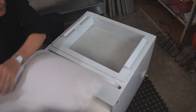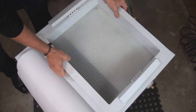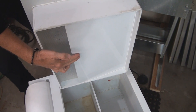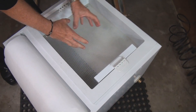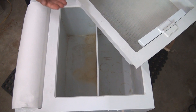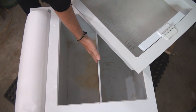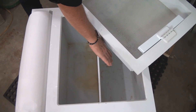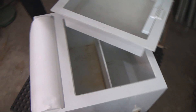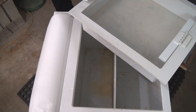As far as the internal part of this, the grate is a perforated polypropylene case. Inside that we have a wing dam — kind of like a waterfall. Wherever this water falls in, it's going to drain into this section of the tank. That's really important because any solids that fall through the filter media are going to be heavy, drop to the bottom, and stay on this side of the wing dam. The water will gradually fill, roll over the top, and exit through the drain attachment. Basically, any sediment or particles that are smaller and pass through will settle in the first side of the tank.